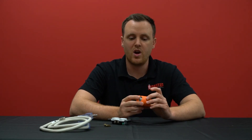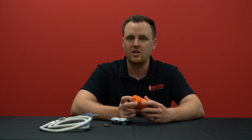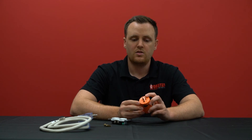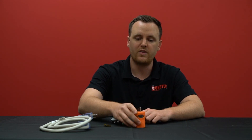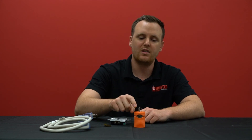Some of our other adapters work the same way because of the wire on the inside, even though they have a 515 plug going to something higher on the other side. Here's a list of our adapters that have 12 gauge or better — that would be 10 gauge — so 12 or 10 gauge wire on the inside of an adapter with a 515 plug.